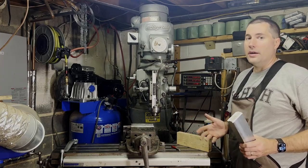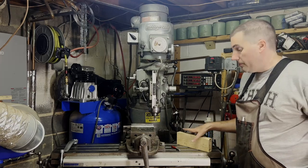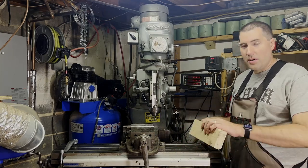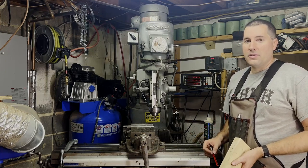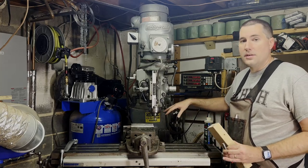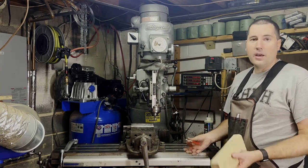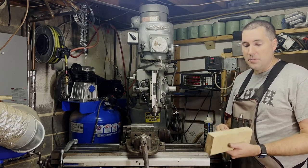However, let's say you're never going to do machining on big blocks of aluminum. There are still a lot of good reasons to get a Bridgeport instead of a drill press. Say you've got a piece of wood and you want to cut a big mortise — you're making mortise and tenon joinery. Your part is kind of small so you don't want to use a handheld router, and it's a bit sketchy on a router table cutting a big deep slot with a small part. Not exactly the safest. Instead, you could do it on the Bridgeport. Some purists say you should never cut wood on a Bridgeport — the ways are all covered in oil and wood chips absorb the oil — but it's not the end of the world, you can just clean it out and it won't hurt it in the slightest. So let's put this big router bit in and cut a nice deep mortise in this piece of wood.